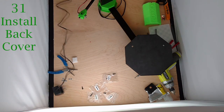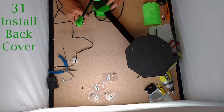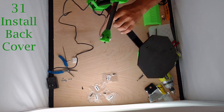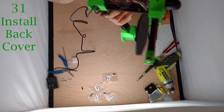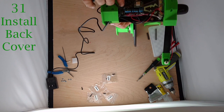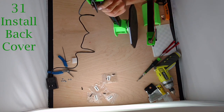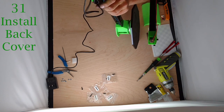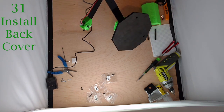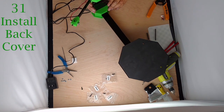After you put on the turntable, we're going to take the power supply — which I've unraveled — and thread it up to the bottom with the other cords. It's very important that the power supply goes into the jack in the shield, as opposed to the jack in the Arduino. There won't be enough power to the unit and it may fry the Arduino if you put it in the Arduino jack. Insert it in there. Got your three cords coming out — slap the back plate back on.